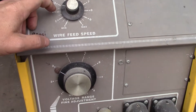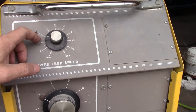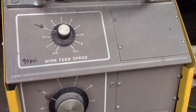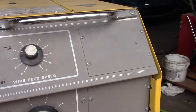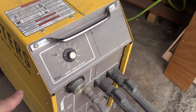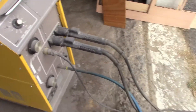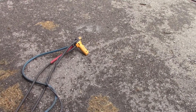These dials you'll never have to move, but it's marked 3 and medium, then your on/off switch. I did have some problems — this thing got bumped up, it's easy to do, and I was having all kinds of wire feed problems. I was out here half an hour messing with it, then I realized my wire speed was off. I reset it and did the whole car in one sitting. It was night and day, so that's something you gotta watch because it can bite you.